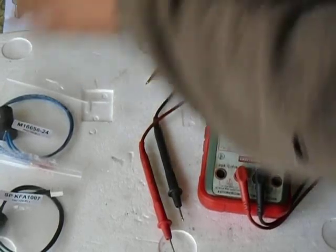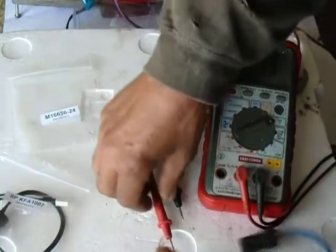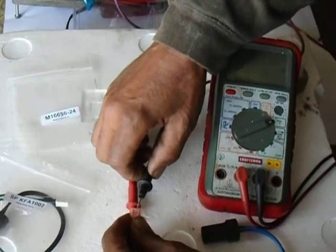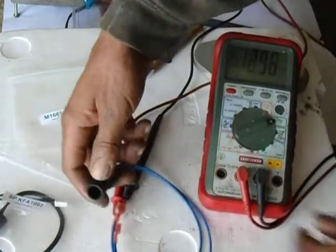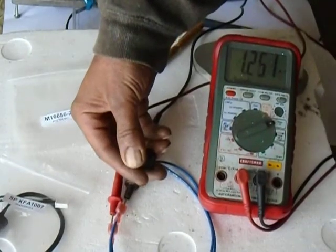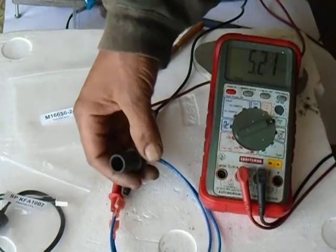Let's go with the PP236. Now we're going to go with the PP236 — plug that in. I'm going to cover it up with my finger: very little ohms, 1.3, 1.2, very little ohms, nothing. Take my finger off and we go up to 5.